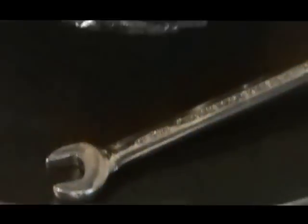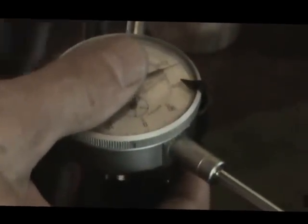As you can see, Byron's got those nuts and bolts here, which he'll center. Then he has his little gauge over here, it's on a rotary table, which you see down here, that he will turn and make sure he's true. That'll go right up against that dummy shaft. You'll get that all centered up nicely. We don't want to have to pour this and melt it back out and redo it because we rushed through it. Better off take your time, get it right the first time.